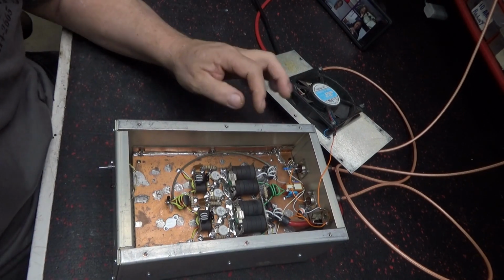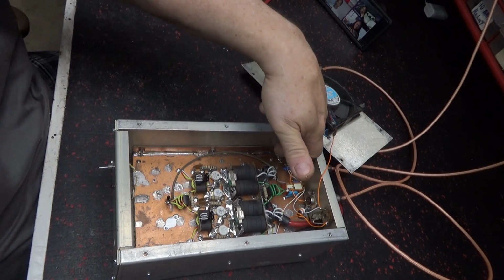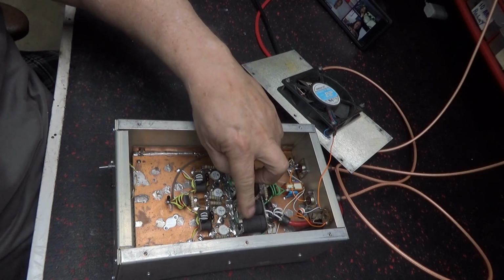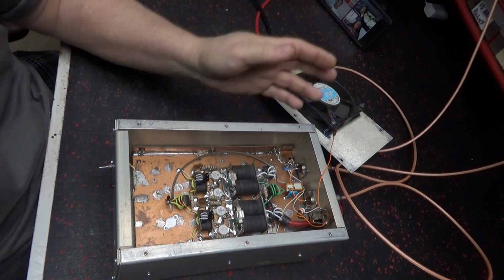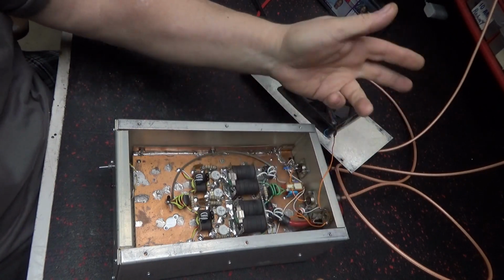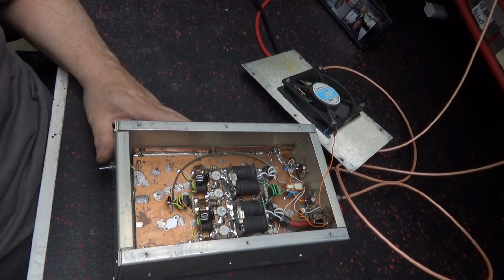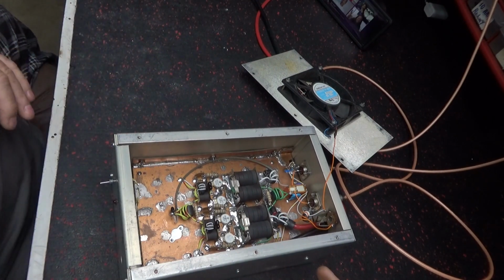If I put it in something else, that'll arc again. New relays, new output cap, new wire here, new key up circuit, new wire pretty much all the way through the whole thing. Reused his transformers, his 1000 pF, but all the wires new, diodes new. 104 is the new, power wire is the new, it was his input transformer. Three of these transistors are his, that one was blown. So I grabbed another used one and put it in it.